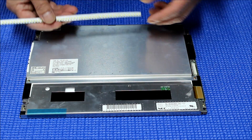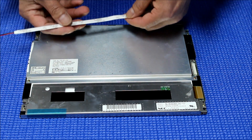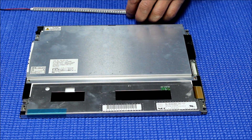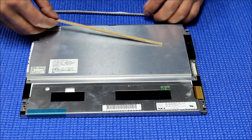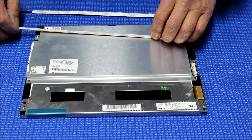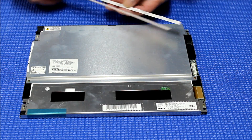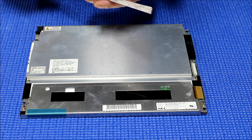You have two options. One option: you peel off the cover sheet — double-sided cover — slice it in and stick it on the bottom. The next option would be to purchase an additional 54mm heat sink, stick them together, and slice it in, so it spreads heat much further. I would suggest that you buy the additional heat sink.